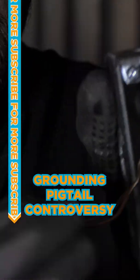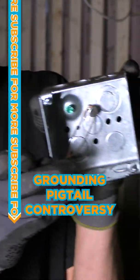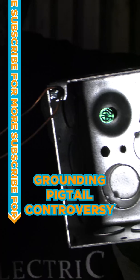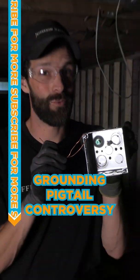But you can mid-strip the conductors on your incoming cable. What you cannot do is wrap the grounding conductor around the mounting screw of the box or the mounting screw of the cover. That constitutes a violation of 250.148C.